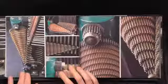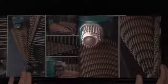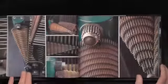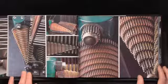The crank does not rotate the cone gear set directly. This gear is attached to the crankshaft and in turn engages the cone gear set. This is why it takes 4 turns of the crank to rotate the cone gear set by 1 revolution. Without this gear reduction, the crank would be more difficult to turn.